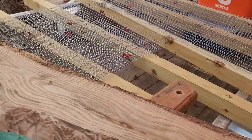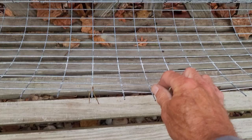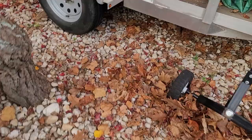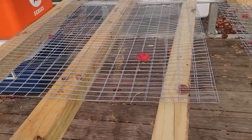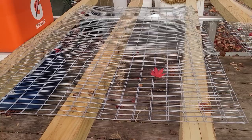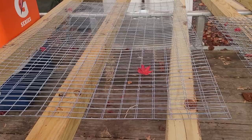Here is the cage material I'm working with. As I spool this out, when I'm using two hands it's better, but I flatten it on this bench so it lays flat. For this cage build, I'm using this top piece and I find it's better if you do it all in one piece — that way it keeps the structural integrity. This is 56 inches from one end to the other. That gives me 10 inches plus an inch and a quarter to inch and a half egg rollout spacing, and then 12 inches in the back for the tray slant, giving them 10 inches to stand in but 12 inches from horizontal.